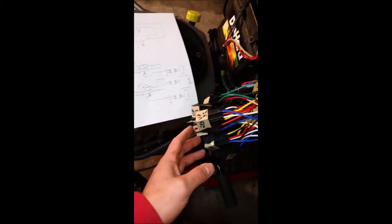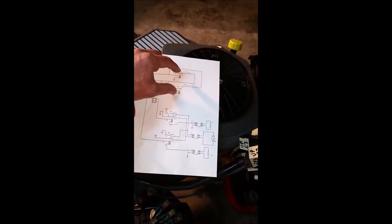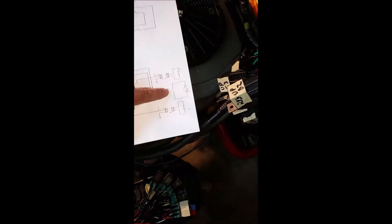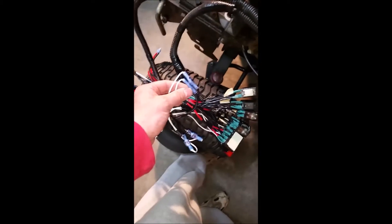Quick clarification: this group of relays has two relays per channel, where one channel controls one load. Just look at my other video for a full explanation. The new harness I built also has two relays per load. In this case I bridged the run switches together since I'm not using limit switches, but I put the connectors there so that in the future I can add run switches in series — two per channel — if I ever want end or run switches.